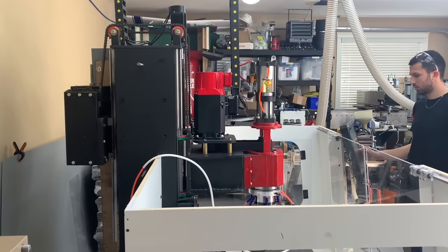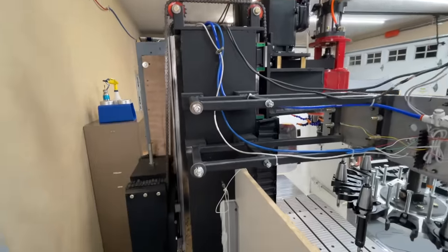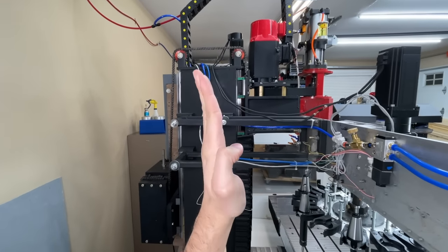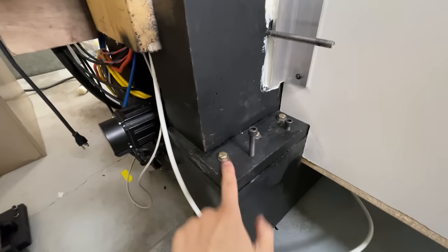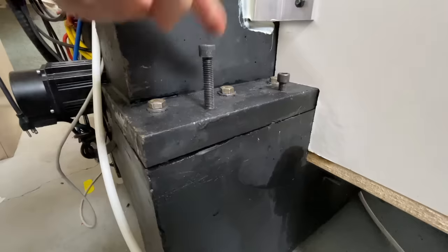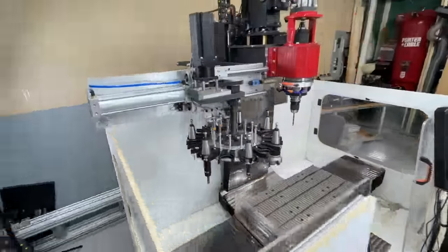Here's a quick shot of how the counterweight slides when we move the z-axis up and down. Many people asked about tramming — specifically, how we account for angle offsets in the column relative to the cutting table, whether front-to-back or left-to-right. This here is our mechanism: we have three half-inch bolts on each side that pull the column down into the base. We can loosen those and use the 3/8-inch bolt to push down on the base and elevate the column. This design worked really well, confirmed with a dial indicator.